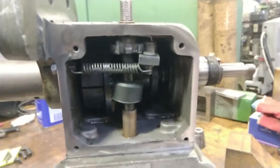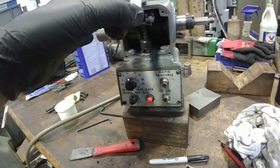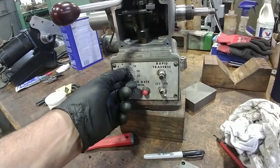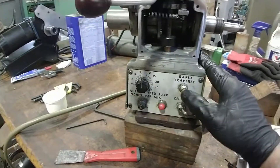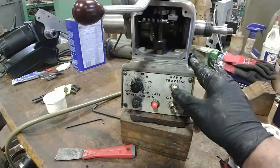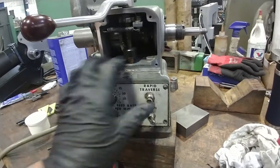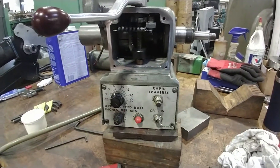Having the right tool is wonderful. Power on, we got a light. Let's turn the speed down so it doesn't jump — go left, speed up, and we got absolutely nothing. Nothing on rapid either. There should be a boot over these — we'll replace those two. Chances are because this was leaking, oil got inside the controls and coated everything, so the next step is to kill the power, unplug it, and dive into the electricals.